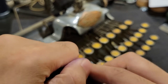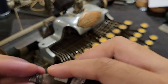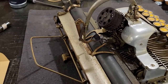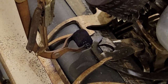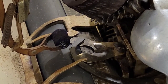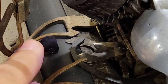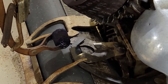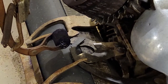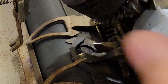So, these would contain your pre-inked ink rollers. I'm not going to take that one out, but now I'm currently using one here that had probably never been used before, though I did have to apply some solvent in this case, just liquid wrench, my catch-all, to help dissolve some of the original, I guess I call it, I believe it's called the carrier, or the vehicle, that basically allows your pigment to flow from the reservoir, in this case a felt, onto the paper, or onto the typeface.